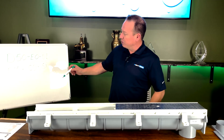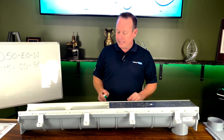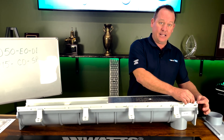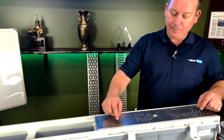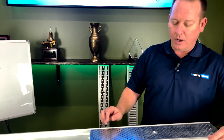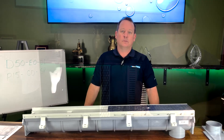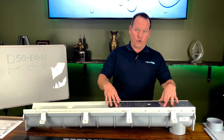So we've got two different model numbers — one heavy-duty with ductile iron, and one lighter and fancier. One thing to add: along with the stainless steel perforated grate, you can also add a stainless steel frame guard. That wraps around the frame — it doesn't get installed permanently, it just lays over it — but once the concrete is poured, you get a beautiful stainless-steel-on-stainless-steel look all the way across.